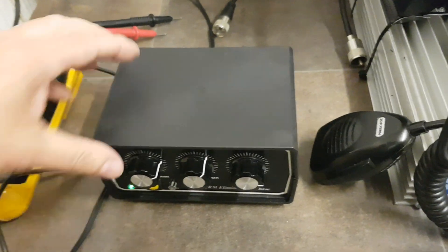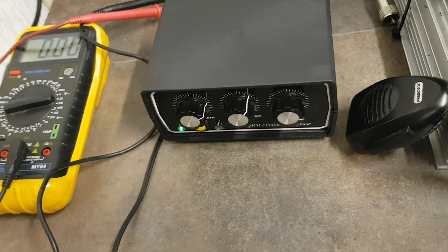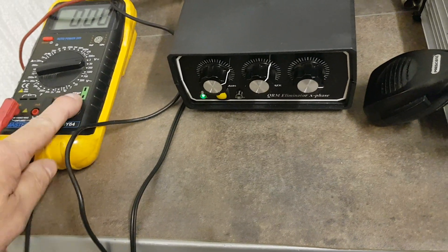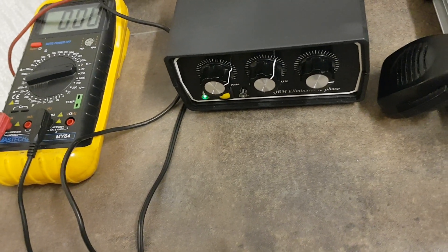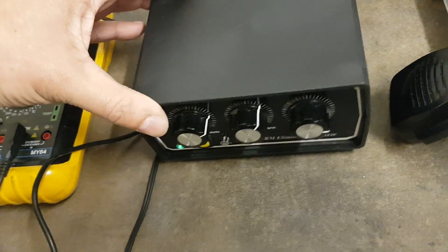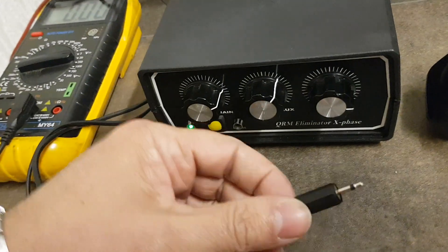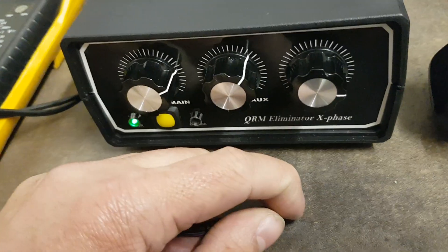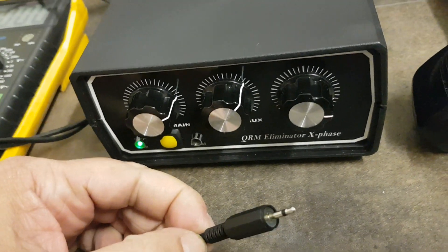I'll give you a few ideas now. If you want to buy the kit — spend £20 on the cheap kit — it brings electronic parts and components but no boxes or buttons, which you'll have to find on eBay. If you've got some knowledge with a multimeter, you can find voltage values to power a relay inside your radio to open and close the circuit from the finals. A simple way is to buy a foot switch — whenever you're transmitting, pressing it will make the connection between the two PTT control cables, closing the circuit.